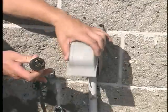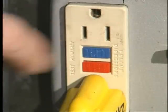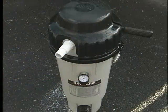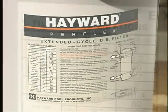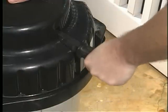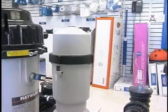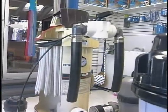Make sure that all of your electrical connections are grounded and test your GFCI. Turn on your filter system. If you have a DE filter, add the required amount of DE — refer to the side of your tank for the amount needed. Expect to bump the filter several times during the first 24 hours of operation. For more information on operating your DE filter, please view DE filter operation in the next chapter.